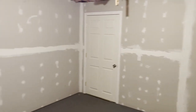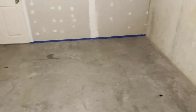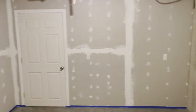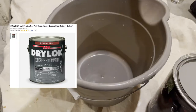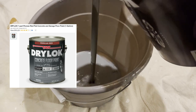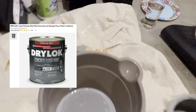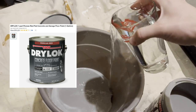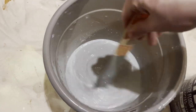Welcome to day one of the turtle room with lots of work to be done. It had a carpet duct-taped to the concrete floor — threw that away obviously — and there is our beautiful concrete floor and our unpainted walls. The first thing I did was deal with the floor, so I went with Drylok for concrete floors like a basement or garage. It's basically a moisture barrier and protector of the floor. I'll be putting subfloor and flooring over this, but it's going to be the first line of defense from any small water leaks trying to push up through the concrete.